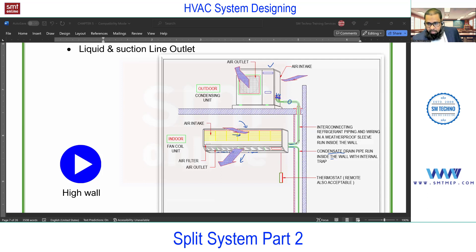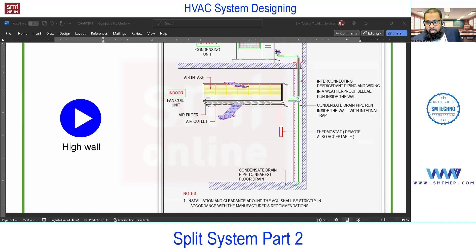We can take the pipe through the wall. In this case, the pipe goes through the wall into a pipe chase, and through the pipe chase the pipe goes up through the slab connecting to the outdoor unit. Through the slab, a pipe sleeve is actually required. The drain pipe is used to collect water and connect to the nearest floor drain or plumbing drain point — it can be near a kitchen or toilet. Before connecting, one important item is required: a U-trap.